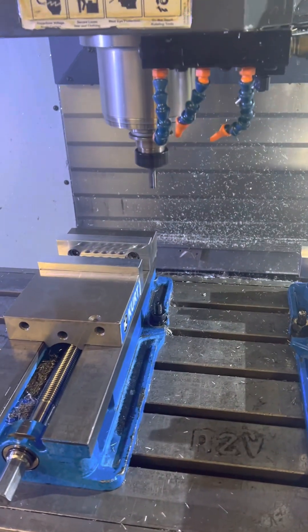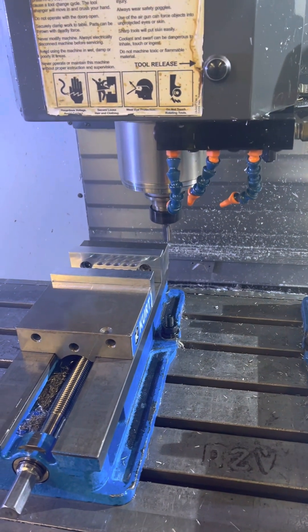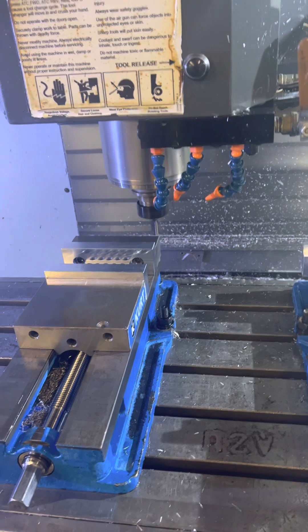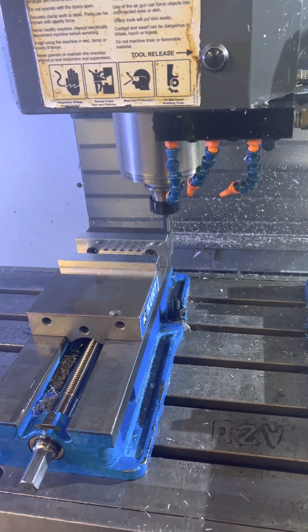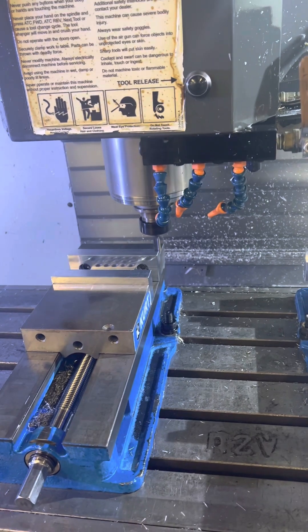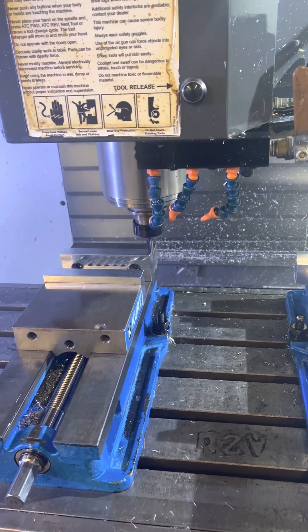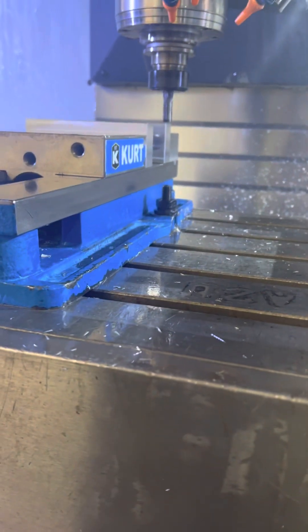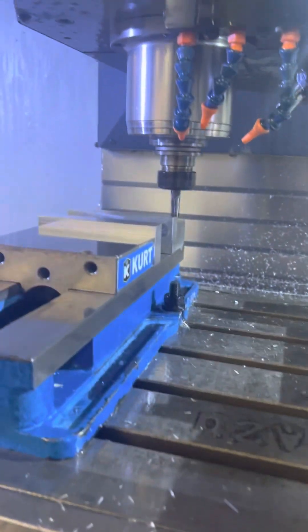Alright, I'm gonna cut you off on Z, position zero of that. Z zero. And I'm gonna go cut you off on Y. And then on my Y I'm going to cut in 500. And Z-depth is gonna go down to 750.